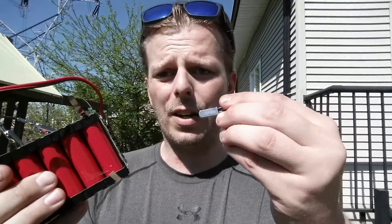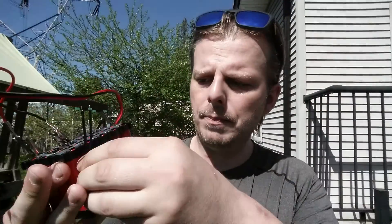What you do is essentially take your thermal switch and mount it with thermal paste or glue right against your batteries like so. You take a bunch of these and mount them all over your pack, so it registers different temperatures throughout your power wall or power pack.